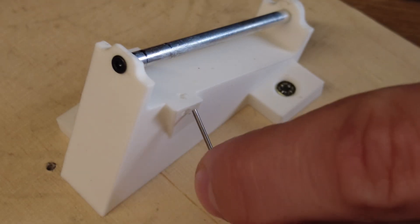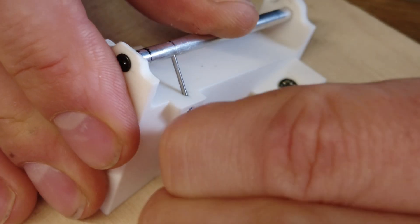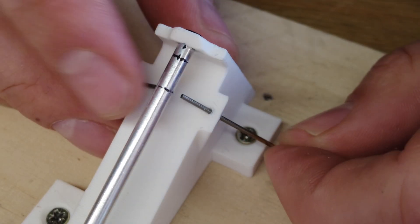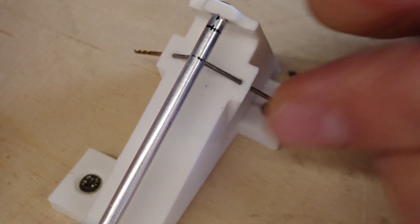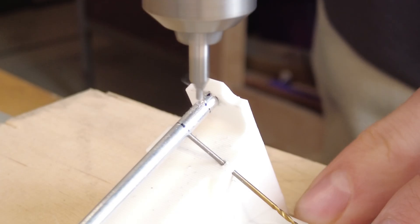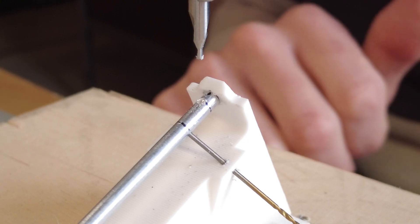To align the tube I used two 1 mm drill bits on both sides of the adapter, then plugged them into the tiny side holes. At first I drill a small hole using a centering drill, then I use a normal drill bit to deepen it.